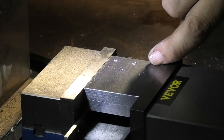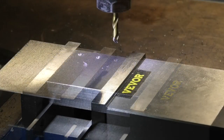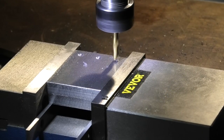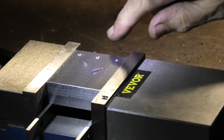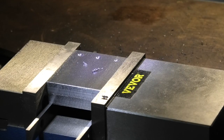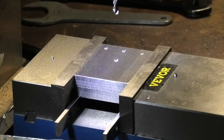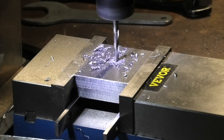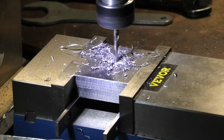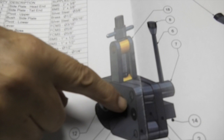There's another hole to come here, which is one and three-eighths from the top hole. So I've got the positions of the three holes marked. Now I'm going to drill the three holes - the tapping size for an M6 - and I'm drilling all these holes with a 5mm drill. This is what we're making at the moment: these two side plates.